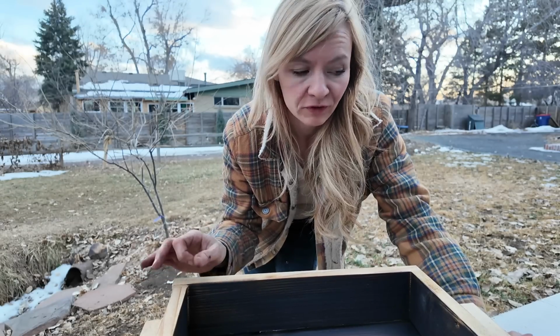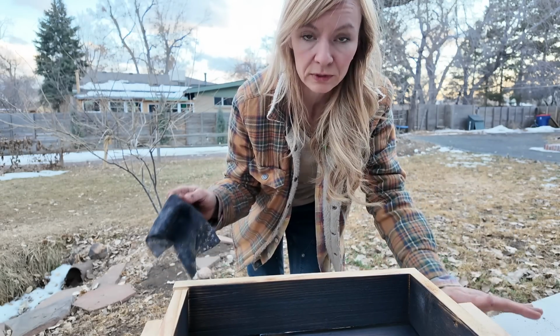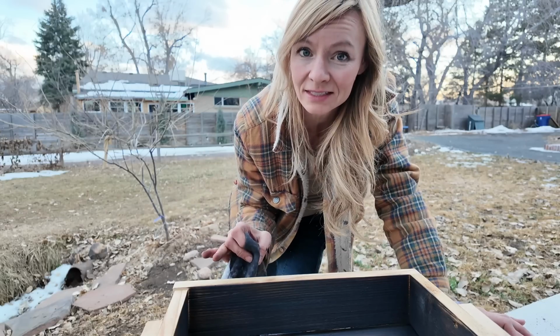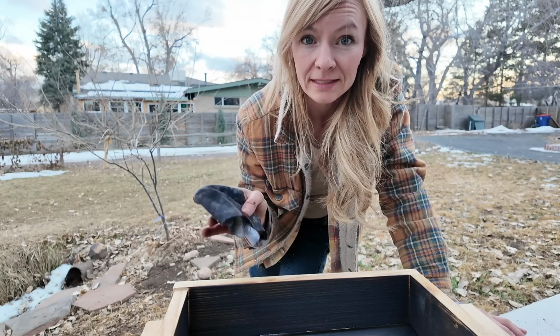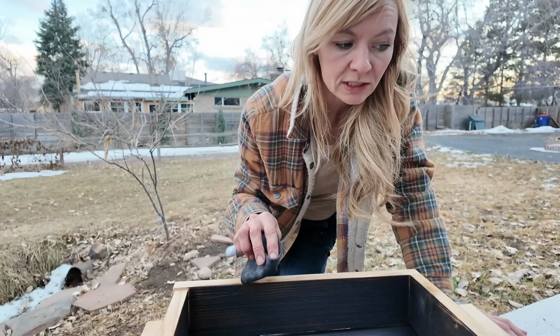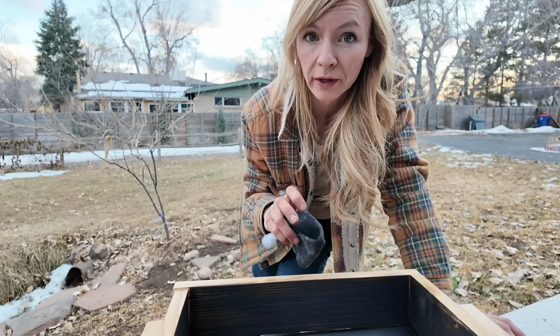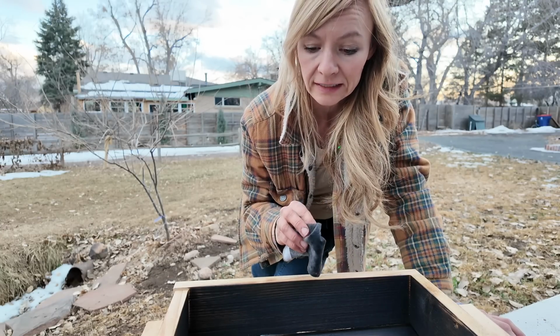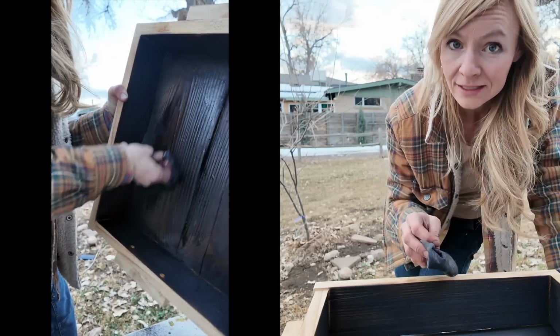In the final waterproofing step, and not everybody does this in Shou Sugi Ban, apparently some people skip the oil step, but because this is going to be in contact with moist soil, the oil really does help to waterproof it. Now, I'm gonna do this once, and then next spring, before I use this tray again, I'm going to re-oil it because I have found that after a season that oil wears off, and then I need to re-oil. I am using boiled linseed oil to do this.